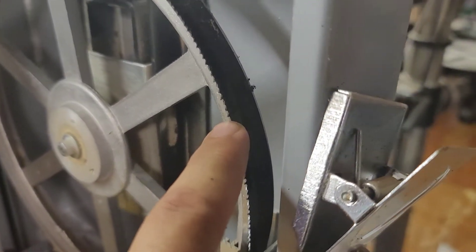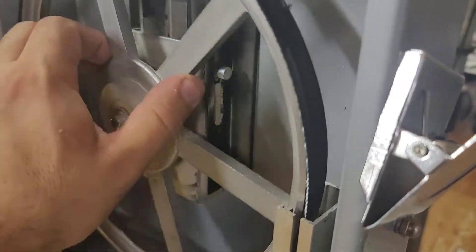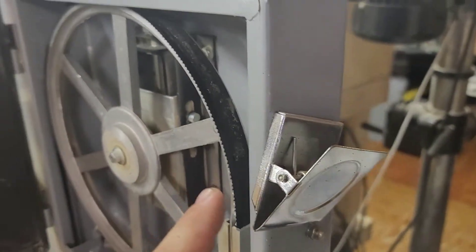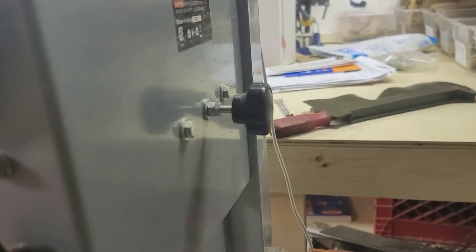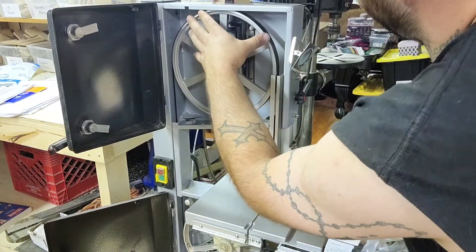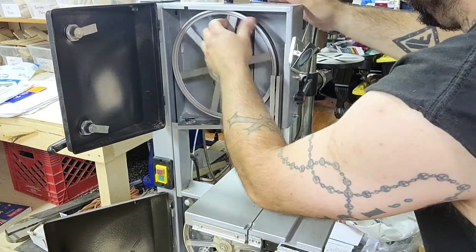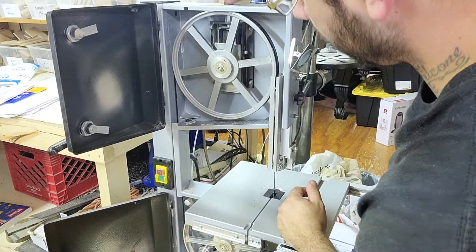As you can see, the blade went right to the edge — and if we keep running it in that direction, it's going to walk itself off and it's just not going to work. So what we need to do is angle the blade, or angle this wheel, so it stays in the center. To do that you need to adjust this — I went ahead and loosened the lock nut, loosened that nut, and now you have your camber adjustment right there. Go ahead and adjust it while spinning. But that walked way too far off, so I'm going to turn that back.